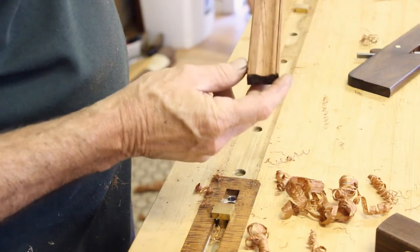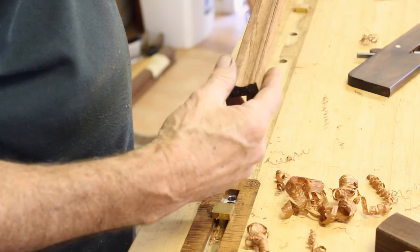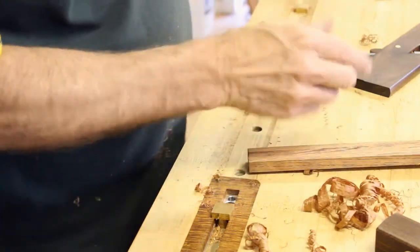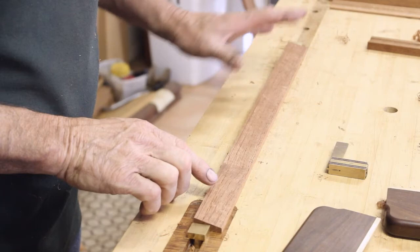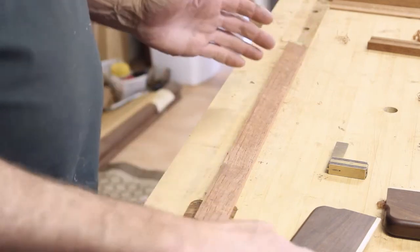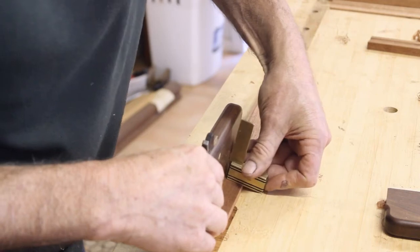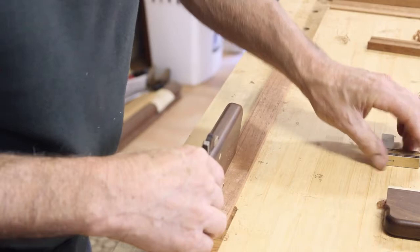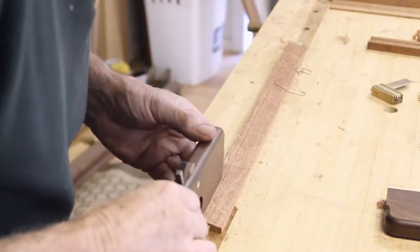That's done on the flat piece of wood now. We'll have to go and saw that edge at 15 degrees and then cut the other side to make it into that profile. Now we're going to apply the moulding the same as before but to the 15-degree angle piece of wood, just to show you the difference. The main difference is when you're using your planes you need to make sure they're angled at 15 degrees — or your plane is square to that surface. Same applies — we just do a couple of passes.